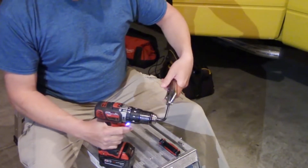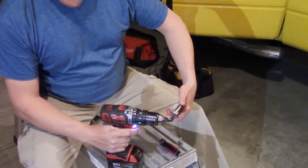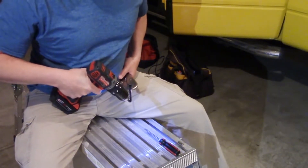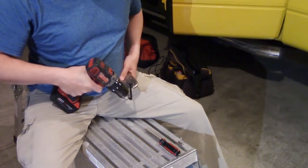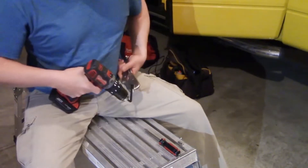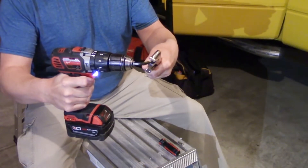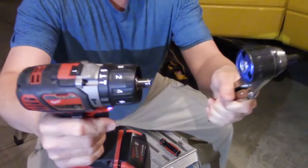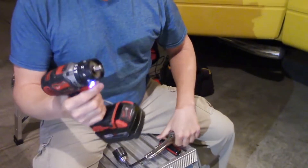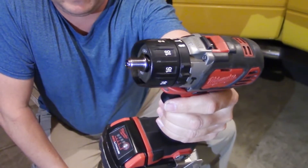Now this here is the hard part. That's still going forward — I need to change that to reverse. So we're in the reverse direction on the drill; it's going to spin counterclockwise. We're going to get it really well supported here and use the full torque of the drill. If you have a much larger Allen wrench, that makes this easier. Here we go. You hear that snap? I broke it loose. And there we go, guys — the chuck is loose. Now on a half-inch chuck, your standard mounting screw or stud is going to be a half by 20.